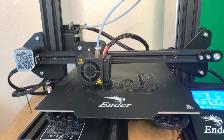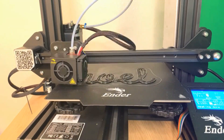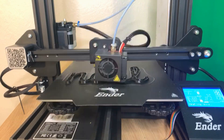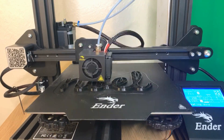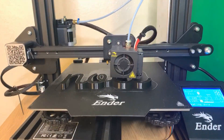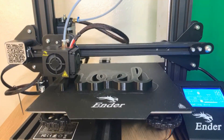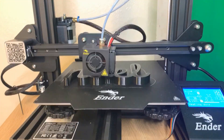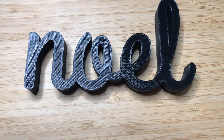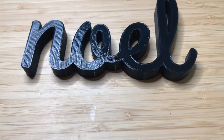I'm not sure what I'm going to put in the resin first. The biggest test is going to be whether the 3D print lines show through in the silicone and then in the resin. You need to get the 3D print as smooth as possible because any ridges will show in the silicone, and if I create a mould with that silicone it's going to push through to each resin product I make. I'd rather sand down the one 3D print than sand down every finished piece.